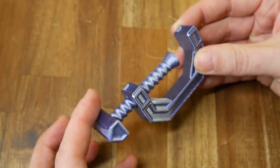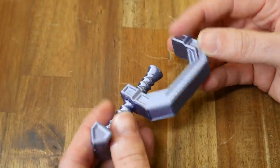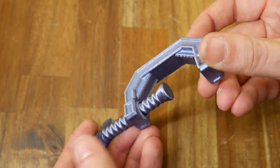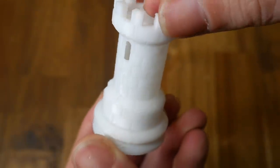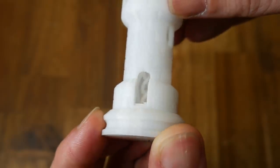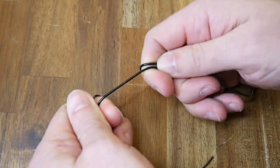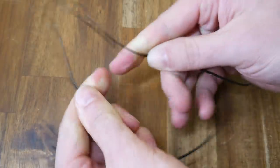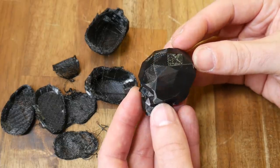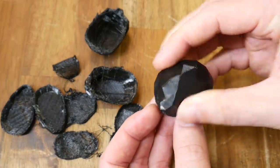I used this print-in-place clamp to test accuracy as well as cooling on overhangs. Once again, this is a good-looking print and entirely functional as pulled off the printer. This is normally a torture test for resin printers, but I printed it in PETG. The surface finish is immaculate and the tiny internal details aren't bad either. I also tested some mega-stretchy and flexible TPU. It took me quite a few attempts to get the slicer settings dialed in, but the end surface finish is really quite good as well. This is a very difficult filament to print with.